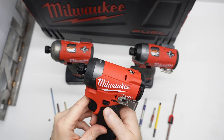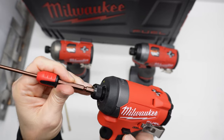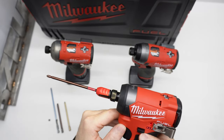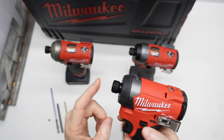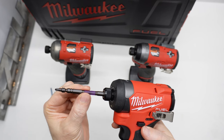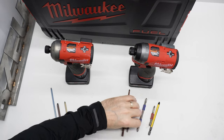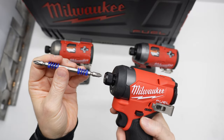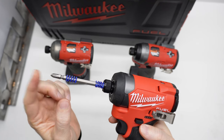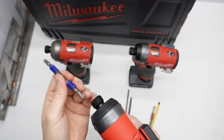What makes the M12 FID2 JP so special is the chuck. The chuck is made for these 13mm anvil bits from Japan. Milwaukee put a very nice chuck in this tool. There's a spring in the bottom pushing the bit forward, with still a little bit of axial play. Vessel has the solution for that with their plastic spring bits, which work perfectly in this tool and take out the axial play. The plastic spring also allows the eject feature to work.